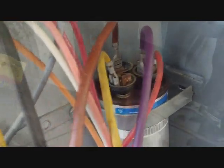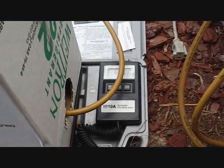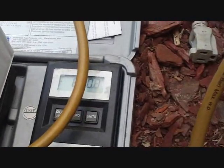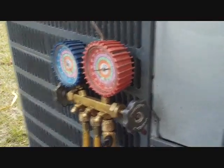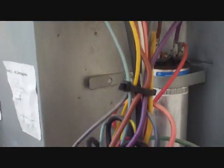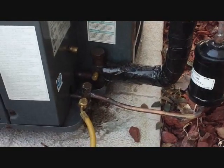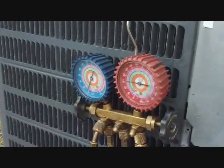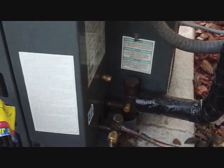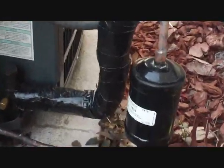Now we're going to start to pull a vacuum. I pulled the vacuum and now we are putting the charge in — my camera died for a while so I had to recharge it. I'm putting it in on liquid right now, but that's about all she's going to take; I'll have to put the rest in while it's running. It's cooled off quite a bit so it's not taking charge as well as before. Our defrost board and capacitor — thank goodness for Goodman. All done here. I put some leak lock on the caps just in case, and brass caps with O-rings on all the gauge ports. Superheat's down to 7, calling for about 8 or so — so we're in the ballpark. I'd rather be a little overcharged than undercharged with Goodman. Got a dryer in, and we're good to go.